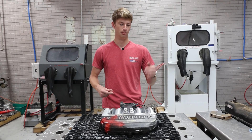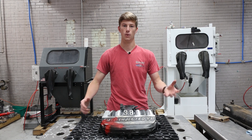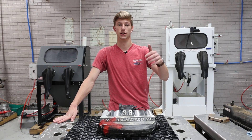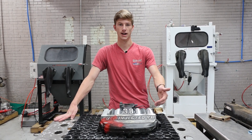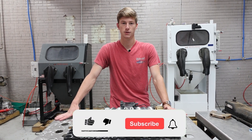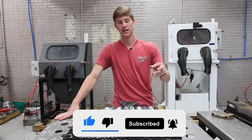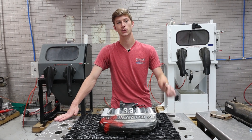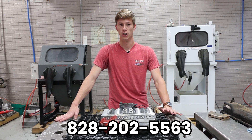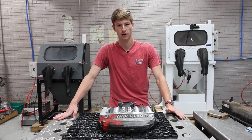The point of this video is to show the different finishes you can achieve and the abrasives you should choose to get there — you wouldn't want to do this whole part in glass bead alone. People often think air pressure determines how well the machine works, but it's actually your abrasive choice. If you want great-looking finishes, go with glass bead, but start with a rougher abrasive to remove paint first. If you have questions, leave them in the comments. To get a machine like this in your shop, call us at 828-202-5563. Follow us on our other socials — we post videos like this every day. Thanks for watching, have a great day!